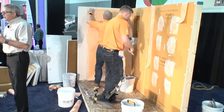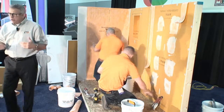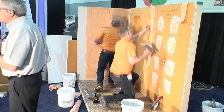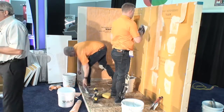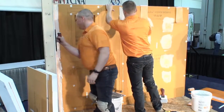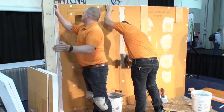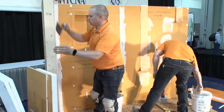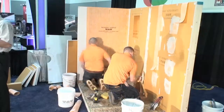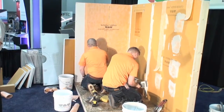Remember back in the day when we floated mortar on all surfaces before tiling? The tile installer was in control of the substrate because they actually created it. When we went to direct bond method, thin set method of tile installation, what did we do? We gave that to another trade to supply us with the substrate that we were going to tile on, whether it was a floor or a wall. That doesn't work for us so well. How many times do you find yourself putting a 12 by 24 running bond on a shower wall and you have to pull every tile on and off a few times to get the lippage out because the wall's not even? We've all been there.